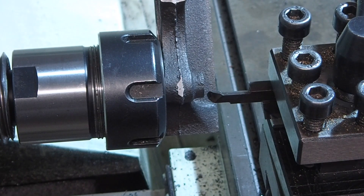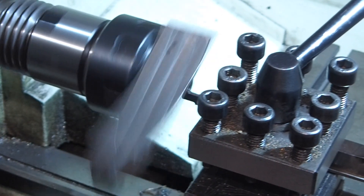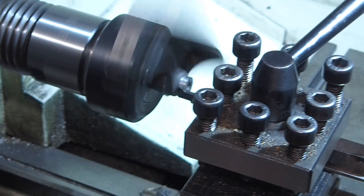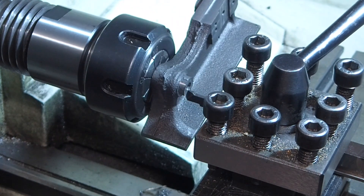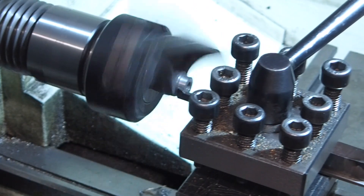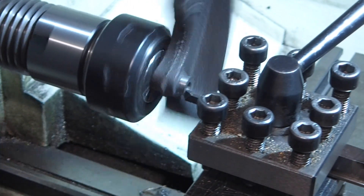Try as I might, I couldn't manage to hold the frame in a four-jaw chuck on the other side — at least not so I got the bush central. Then I thought: I've got an ER32 collet set. The ER32 collet clamped nicely on the freshly machined bush and, of course, the other side was then automatically centred. The next conundrum was how to get a lathe tool small enough in between the bush and the foot of the frame. The only way I came up with was to take a small boring bar that had to be held upside down and then run the lathe backwards. Once I got it set up it all worked quite nicely, so I'm quite pleased with that one.